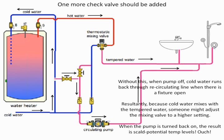That's a good point, because a lot of the solar controls, that's their overheat protection nowadays: let the tank temperature elevate just to keep the collectors from stagnating and breaking down the glycol, letting those tanks go up to 180, 200 degrees in some cases. Sure, and that becomes dangerous for the water going out. And it shortens the life of the components in the system.